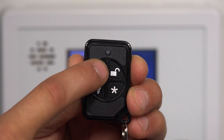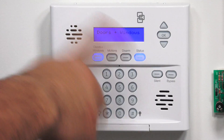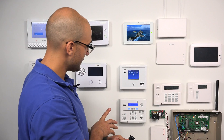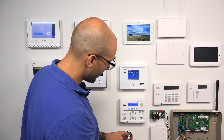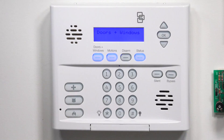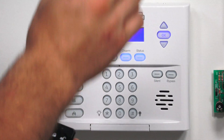Let's see what that actually does. If I press the lock button, you'll see that it says 'doors and windows.' One press means the system is going to arm just the doors and windows — this is your stay mode on the system. If I press the lock button again, it's going to do the doors, the windows, and the motions — so that would be your away setting on your system. Now if I click the unlock button, you'll see that we're disarmed.